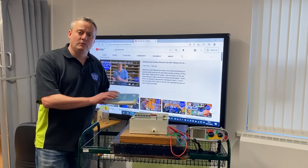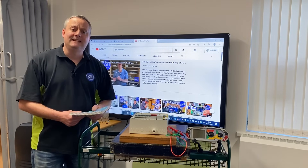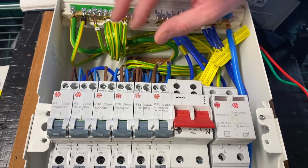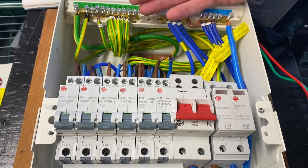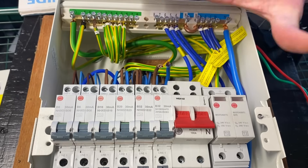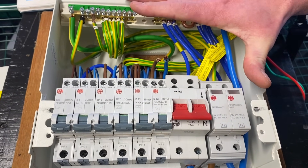In order to help us, we'll look in the on-site guide as well as using this test rig, so we can see the conductors that actually need to be in place before carrying out the test. I've got one of my test rigs here and I've disconnected the 6mm cable that I've maybe tested for continuity, CPC and polarity, and it might be a case now where I'm thinking I can carry out the insulation resistance test with it disconnected from the consumer unit — maybe because some things in here raise concerns when carrying out the test.